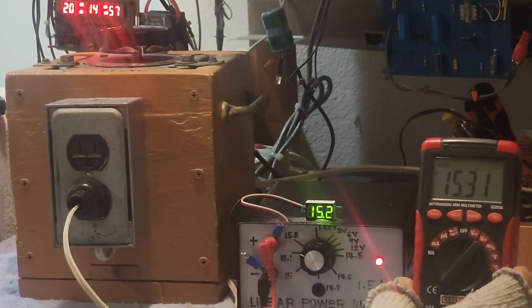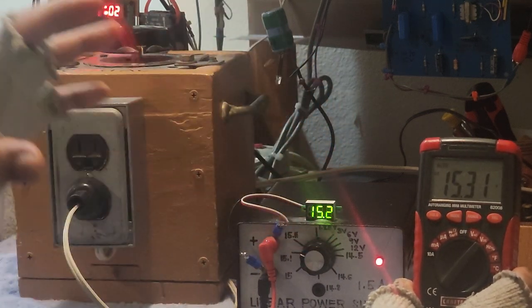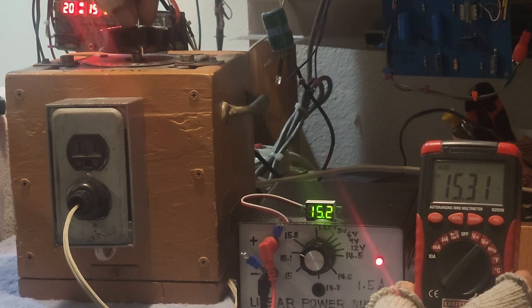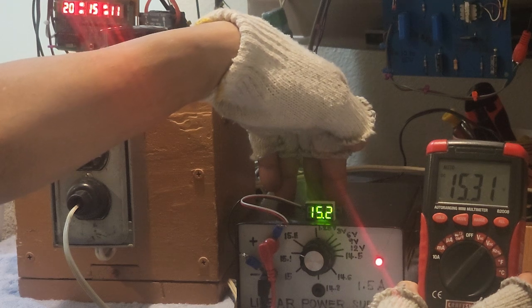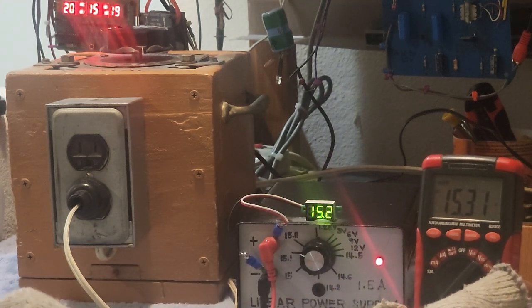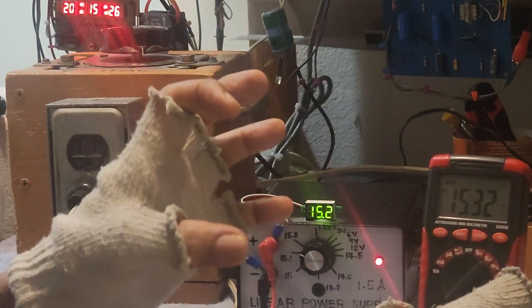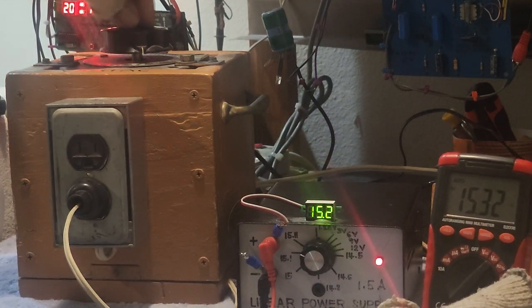So the second method on how to vary the output voltage of a power supply is actually by using a rheostat in which we could increase or decrease its input voltage going to the original power supply. That's the second method. And many electronic enthusiasts or the others who are blogging, I don't know if they don't know this one. So I'm just bringing out this one. So it's a new concept on how to bring out a variable DC power supply by using a rheostat.